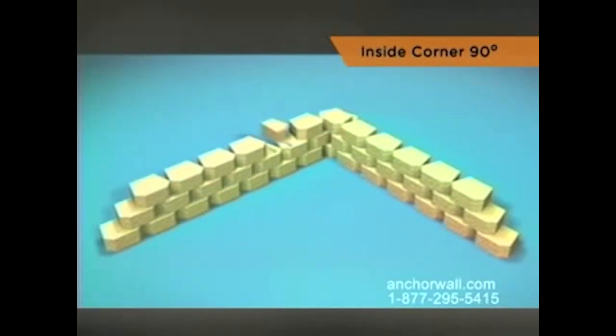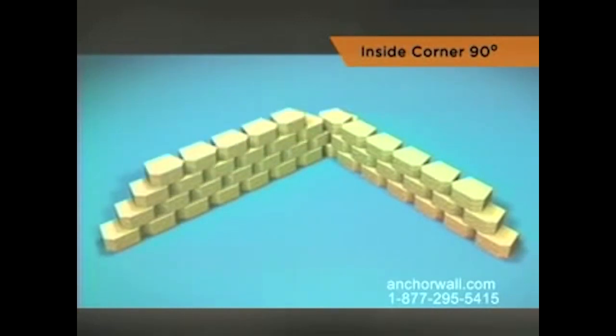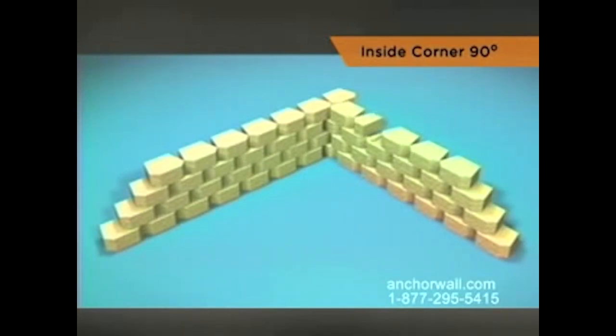The block placement in the corner should alternate direction with each succeeding course. Follow these best practices throughout the construction of your inside 90-degree corner wall.